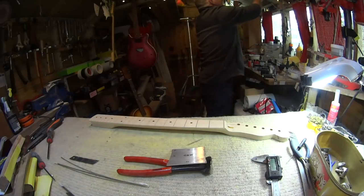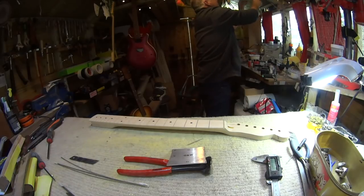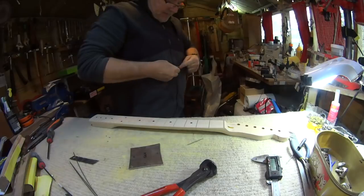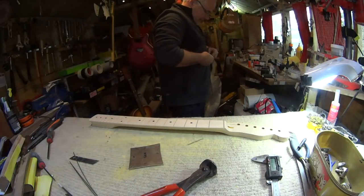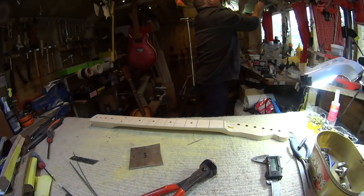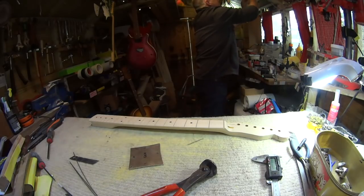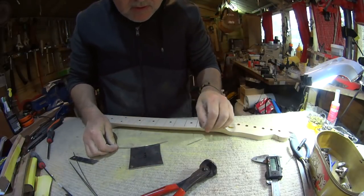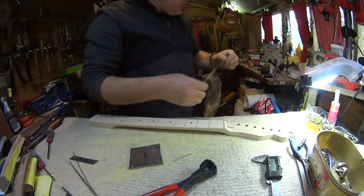Yeah, that's pretty flat. Well, it's flat for that gauge of wire, that's the only thing. So let's crank it up to there. The different size, we need a different setting to achieve the same radius result. Can't be too tight. Yeah, way too tight. Bend it back. Slack it off. Try it again from the other end. That looks about right. That's spot on actually.